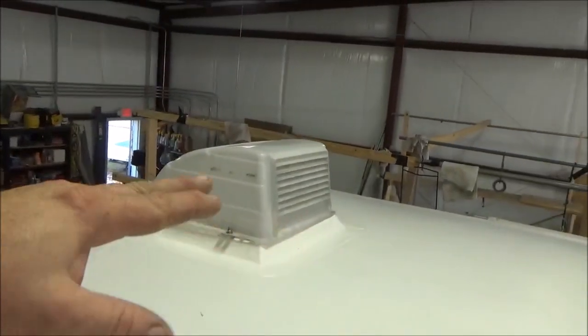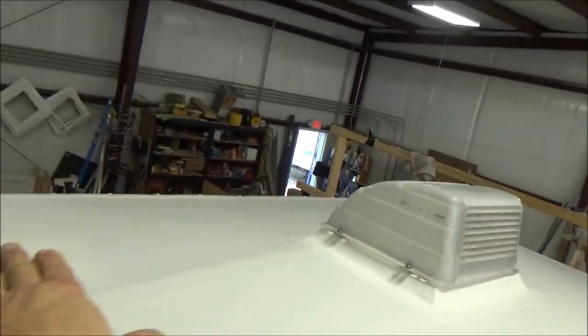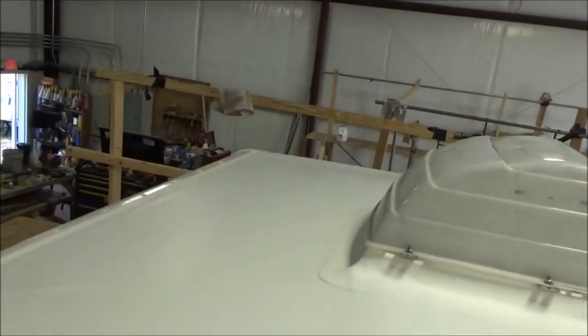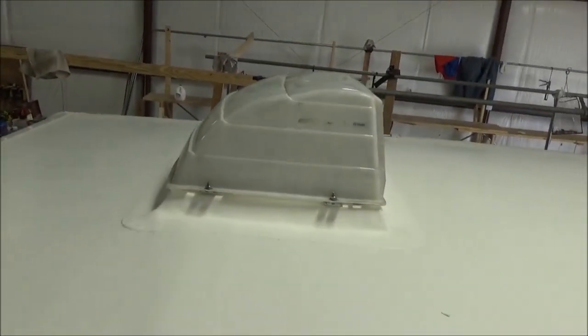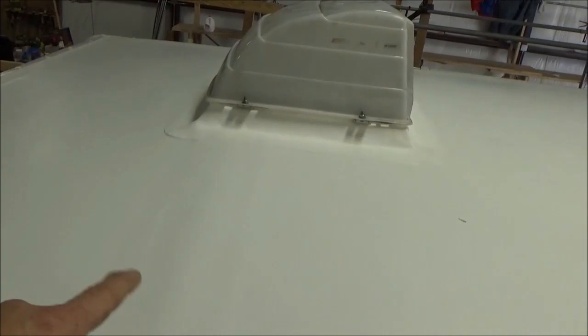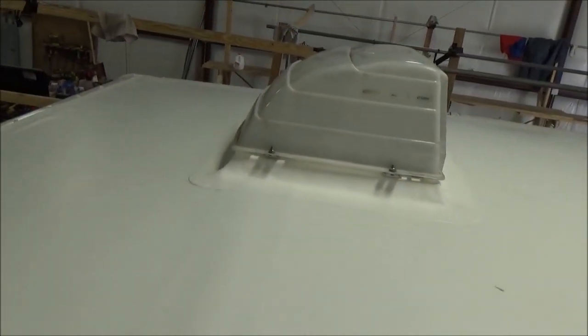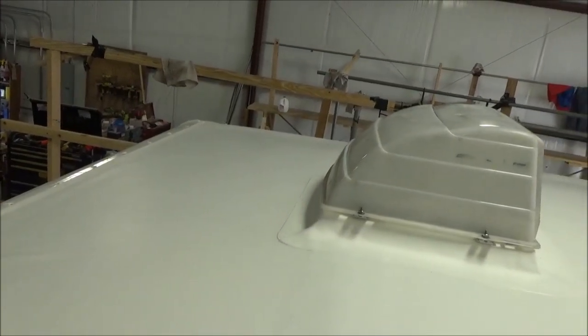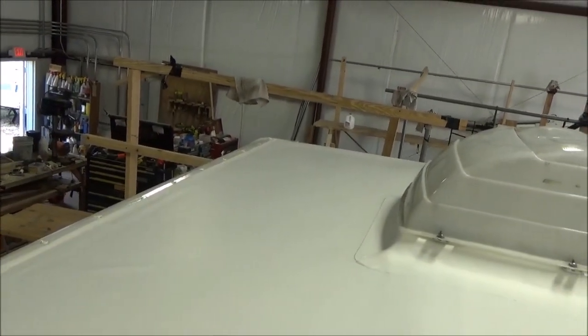This section here on the top — if you look at the way the roof goes, it comes out and then it drops down this way, then it actually drops down this way. We were really working some of this roofing on here, but overall I think it came out well. Considering how heavy this is — this is a 60 mil commercial grade structured TPO — it doesn't usually want to cooperate. We had to work it quite a bit to get it down there to look presentable. I think it came out pretty well though.